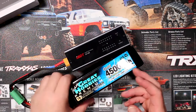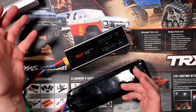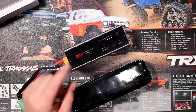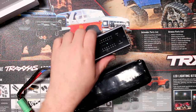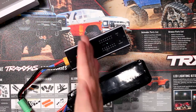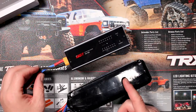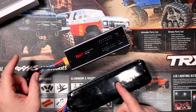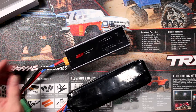If your battery has a dead cell in it, you can plug it onto this and leave it outside — if something happens, at least nothing else gets really damaged, but this guy will take care of it and discharge it completely to the programmed cutoff point. If you grab the programmer, you can tell it what voltage you want. Right now I think it's set at 3.8 volts per cell, but in the software you can change that — even bring it completely to zero if you want.